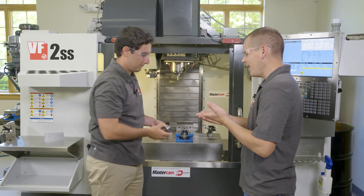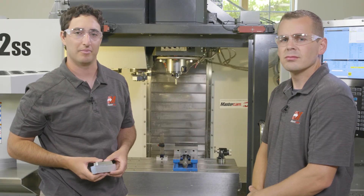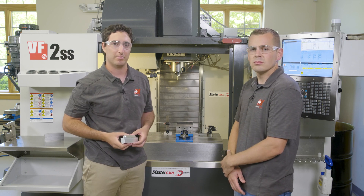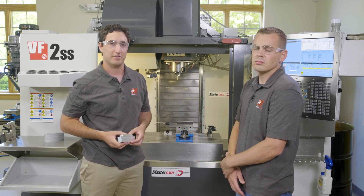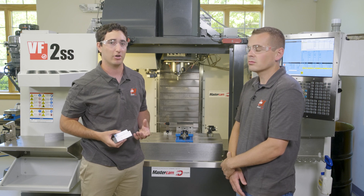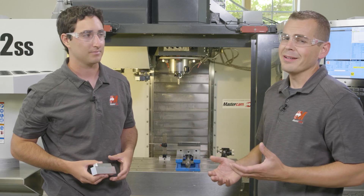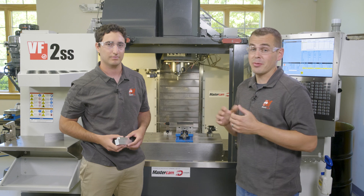So that's interesting, but you did have some mismatch on a few parts, right? Yeah. The stop had moved slightly at some point, and I made a few parts that had a mismatch. When we were initially talking about making 200 of these, I was going to run all the first operation pieces and then switch to OP2. That's common practice, but imagine if something had shifted midway through the run and I had unknowingly scrapped out all 200 of the parts. That would have been a costly mistake, and we probably wouldn't have made our schedule. That's a great point — a huge advantage to minimizing work and eliminating human error from the process.